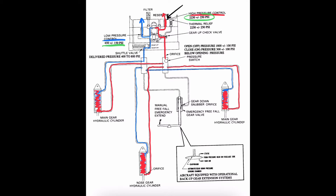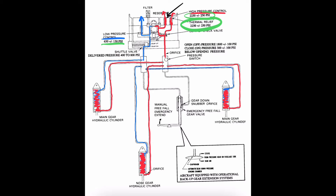The thermal relief valve next to it is based on the principle of thermal expansion. When a fluid increases in temperature it expands and the pressure rises — just like on a hot day when air expands and pressure levels rise in the atmosphere. The same principle applies with hydraulic fluid, and when we have thermal expansion we need a valve to regulate that pressure, hence our thermal relief valve. That's a basic introduction to the pressure differences that occur in the hydraulic system.